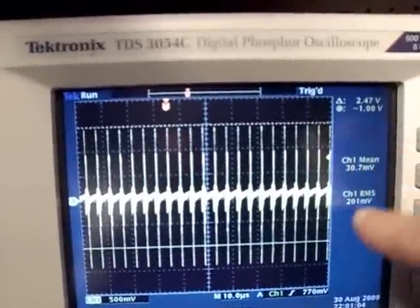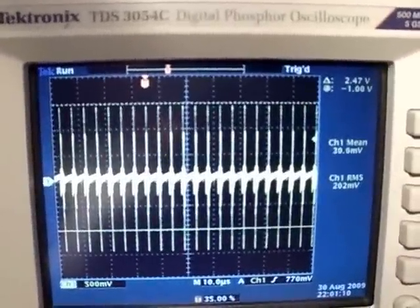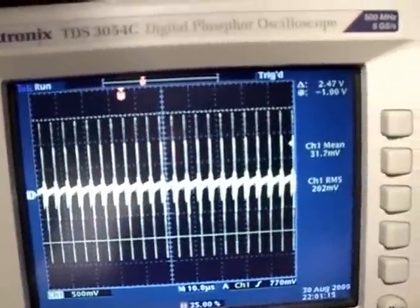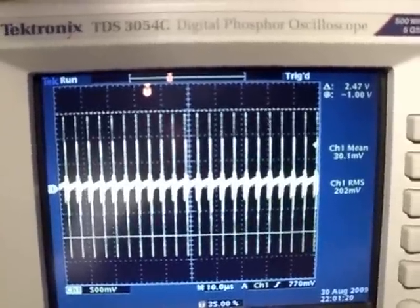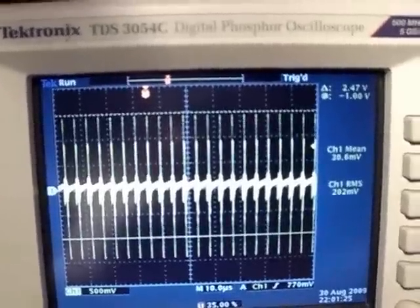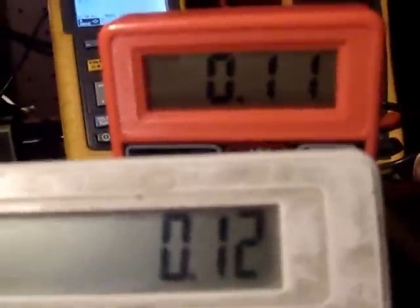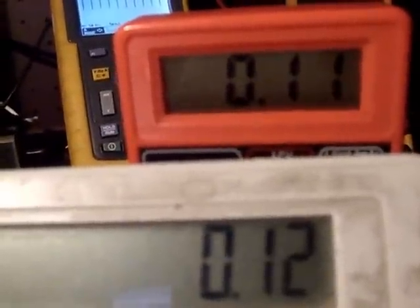Even though it's positive, with that kind of 6.7 times spread, you can get a gain. If you do the drawdown tests, you'll see it. The point of this is that 30 millivolts, which is 0.03 divided by 0.25 ohms on the shunt, is 0.12 amps. I just calculated that right there — 0.12 amps — and you can see that that amp meter is pretty close.